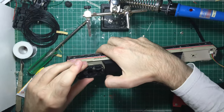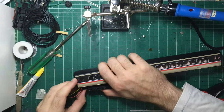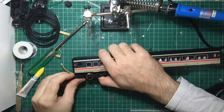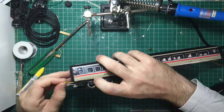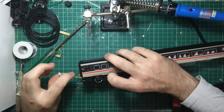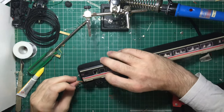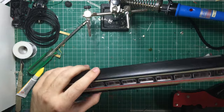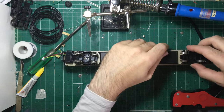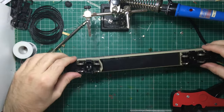So I'll try putting the bogeys back on. I think these are the wrong bogeys so we'll get the correct ones — those are from the Lima cars which I'll need to do in a separate video as they're slightly difficult to take apart. So now that's the bogey and as you can see it clears the wires and allows the bogey still to turn. There's enough space for the wires and I can poke the wires back in. And that's our car now fully back together and fully lit.